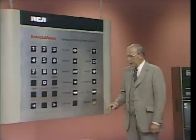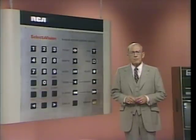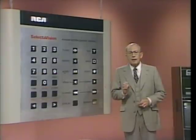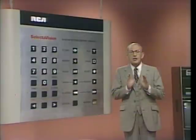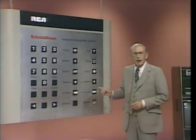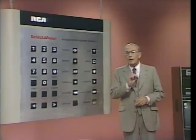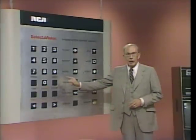If you remember, you pressed the memory key right near the end of band 16 before the 400 cycle to band 22 in our programmed band sequence. The memory key lets you mark any point of elapsed play time on the disc for immediate replay. It tells the player to enter a start time access command that corresponds to the exact second of your pressing the memory key. That way, you can continue viewing a particular program segment and automatically return to the replay point you selected by pressing the Seek key.